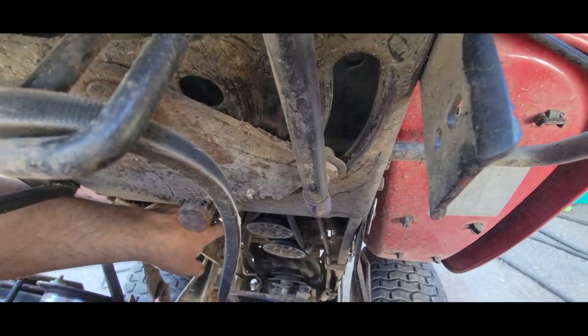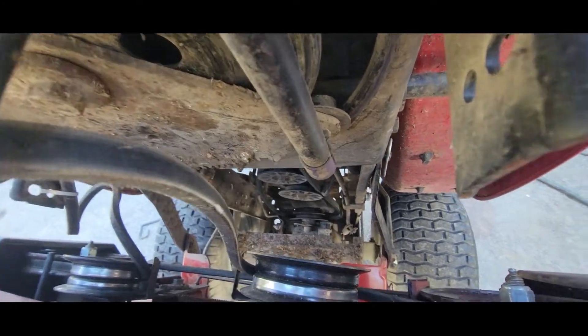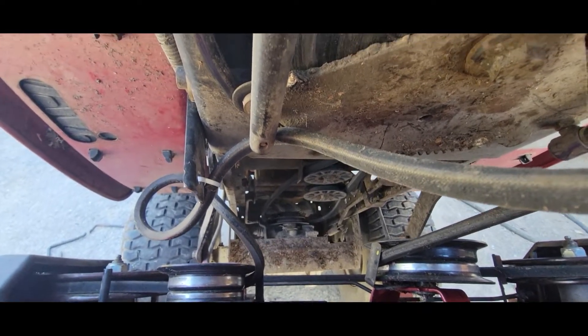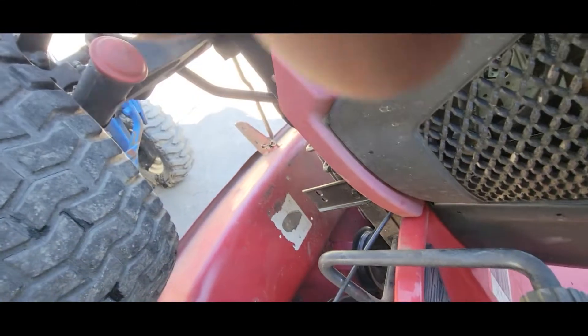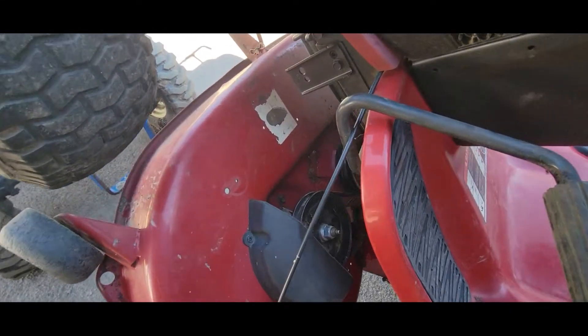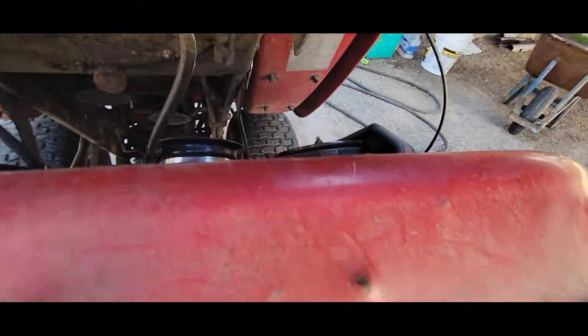There's a guide on this side, right here on the idler, a guide on that side, and a guide right here. The drive belt looks kind of loose. The brake is on — let's let the brake off and see what happens. It wouldn't release one-handed but released with two hands. Let's see how tight that belt is now — definitely tighter, looks pretty tight.